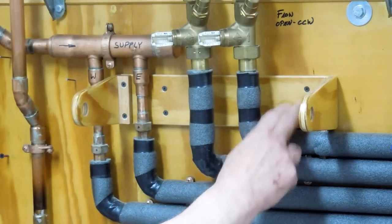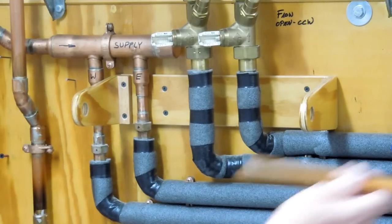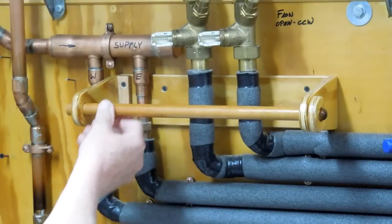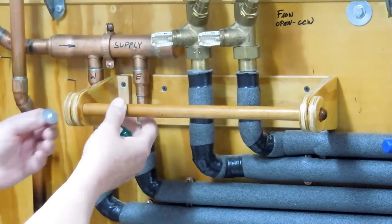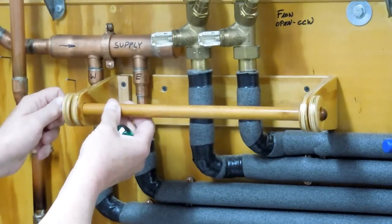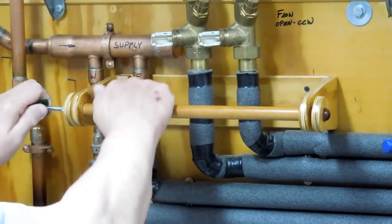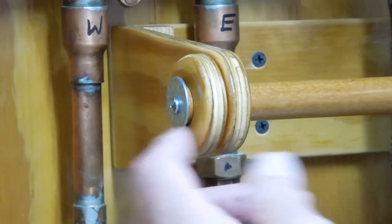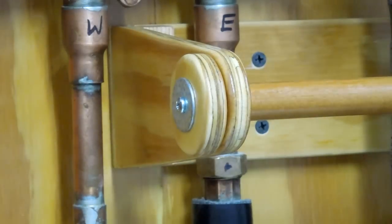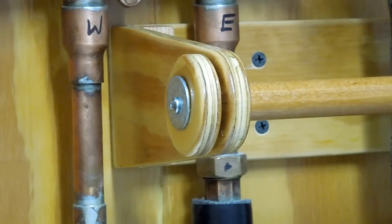This has been mounted to the wall in two places. The removable end has been mounted with two screws. The wood dowel comes in — put that on the end to dress it up a little bit. And the fender washer — this keeps this from coming off. If I ever need to remove this from the wall to work on the pipe, I just remove the fender washer, take out the dowel, and then take down the other pieces.